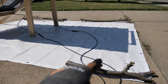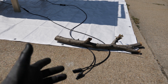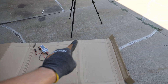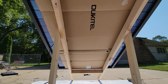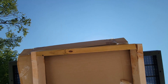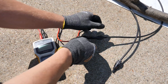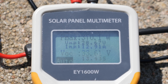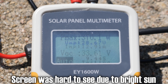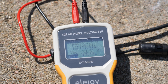I've got my wires ran and I'm going to be out of the way as much as possible so I don't mess up any of the tests. I grabbed some cardboard to slide underneath the bottom of the solar panel, basically covering the entire panel except for a little tiny strip on each side. With the cardboard blocking the back, we're getting about 370 watts from the top side of the panel.